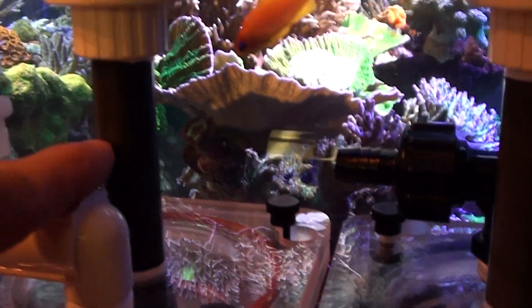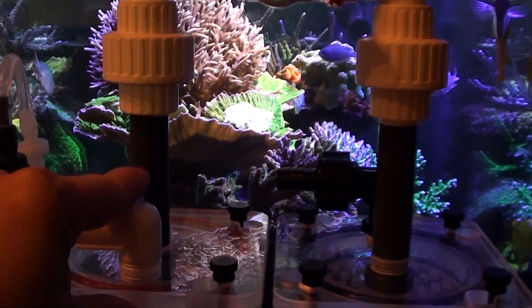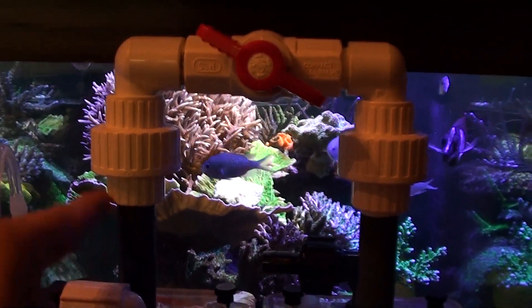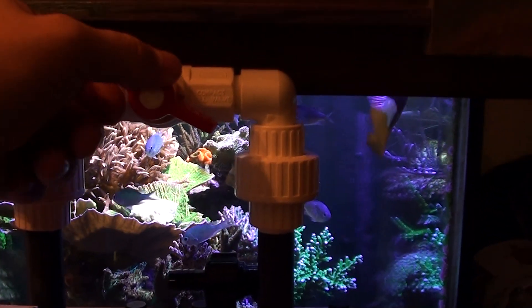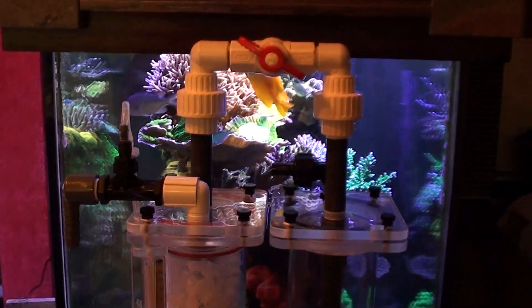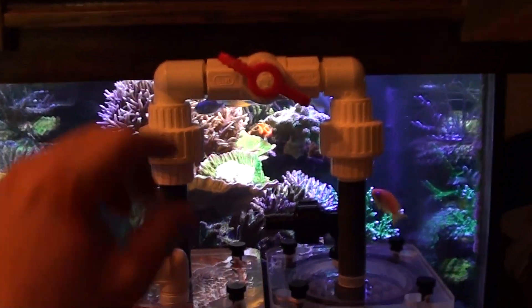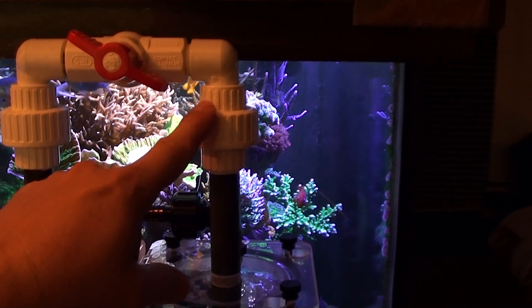The outlet of this is a little bit different than how it comes with the kit because I've got it close coupled. I put PVC in here with some unions. The flow will come up through here through this valve. This valve is intended to create a little bit of back pressure so this chamber down here stays pressurized while in operation, and then basically it will be at atmospheric pressure after this valve.